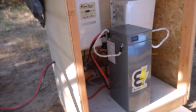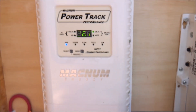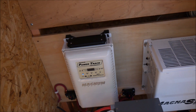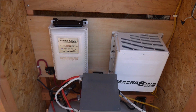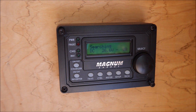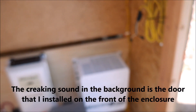To check the systems, I plugged in the Hawk battery and flipped on all of the various breakers. Everything checked out and functioned like it should. This was pretty early in the morning without direct sun, so obviously not much power is being produced, but everything looked good. Unfortunately, they put the on button in the most obnoxious place possible on the inverter, but I managed to find it and get it checked out. The charge controller is functioning, but not producing a ton of power at this point. The inverter is functioning — as you can see, it's searching for a load. It makes a clicking sound back and forth as it searches.